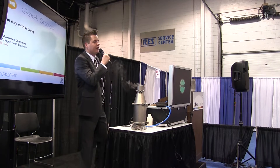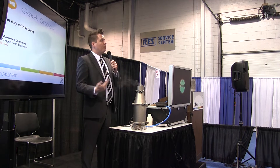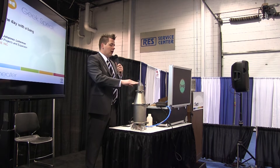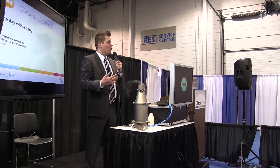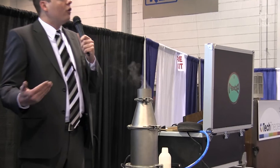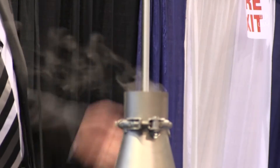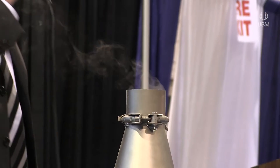The explosion gave rise to a pressure inside the vessel. The pressure rise was approximately up to 10 psi. The opening pressure of this aluminum foil was approximately 2 psi. So it opened and relieved the pressure, but it also relieved the flame — which is why installations located indoors cannot rely on standard relief venting alone.